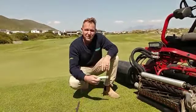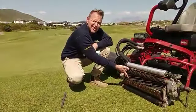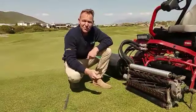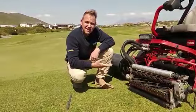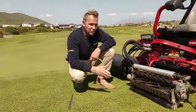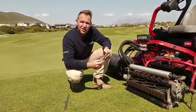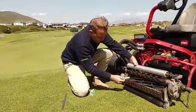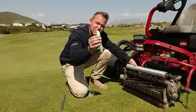When we sharpen these machines, we set the machine to go in a backwards rotation. We then put a steel grit that is mixed with soap. It runs backwards and we set it until the soap and the grit has disappeared. You will then set the cutting height lower and test it to wash the machine. When you test to see if it's sharp enough, we take a piece of paper and it should be able to cut it off cleanly like that.